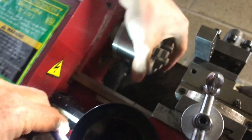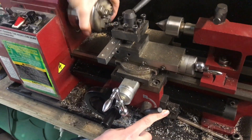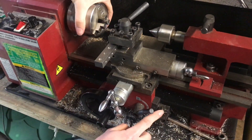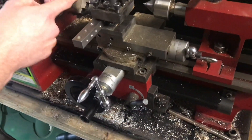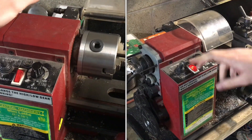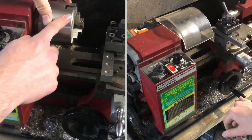This is underneath the way of the lathe — that's the lead screw — and spinning the chuck also spins the lead screw. While the half-nut lever is disengaged, you'll notice this dial here is spinning. The ratio that this spins relative to the chuck is determined by the gears in the back, and that determines rotations of the lead screw to rotations of the chuck.